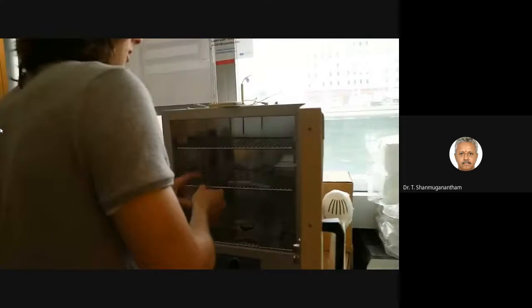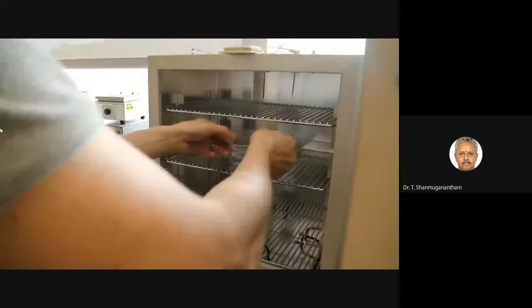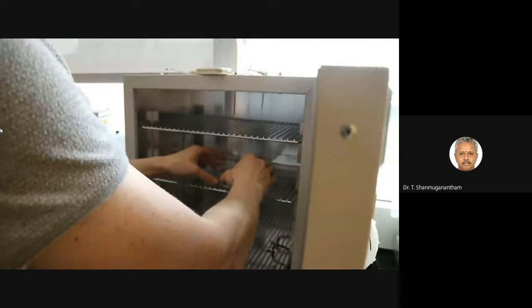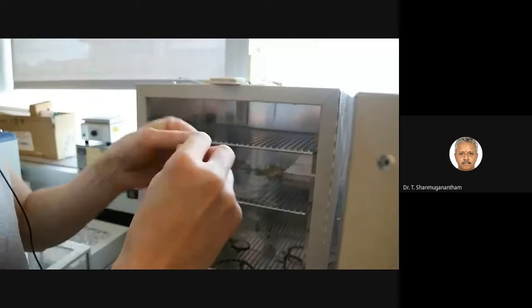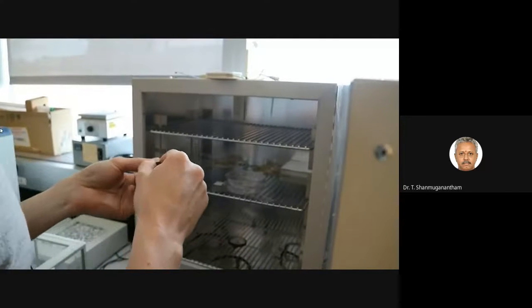So we really need to level it this time and make sure, again, we use glass slides to level it. So we just place it on the glass slides. This is a previous set of the glass slides I used before, so hopefully it's still good, but we'll see. And then we use this little leveler. So we use the circular leveler so we can see all three directions simultaneously.